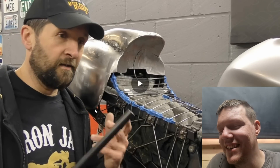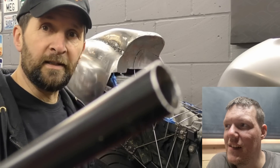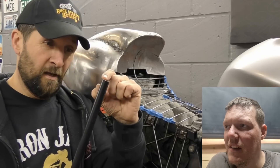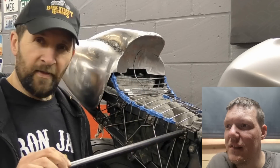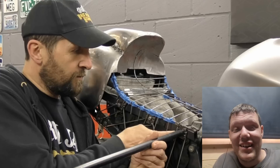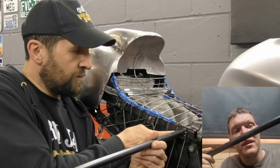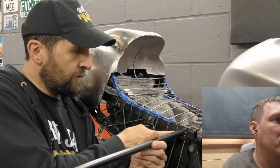When you've skinned it, the simple procedure is going to be to french them. Taking a piece of tubing - that's three-quarter inch tube, might be five-eighths - cut a piece of that off about half an inch, not even. So it makes a socket, maybe 10 mil. Then that'll get welded in. This is conduit, about two metres long - if you're going to use fibreglass and resin, why can't you use a plastic tube? It's lighter, you're going to glass it up anyway.